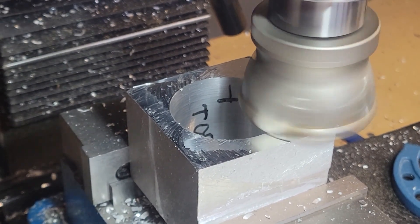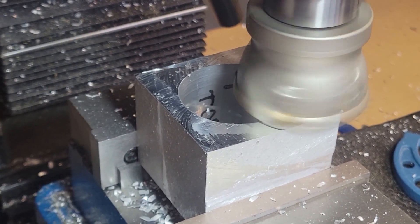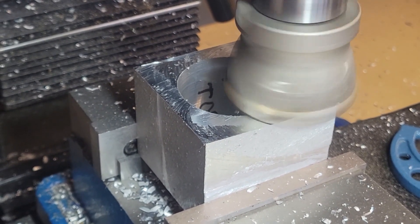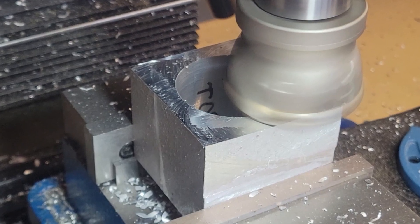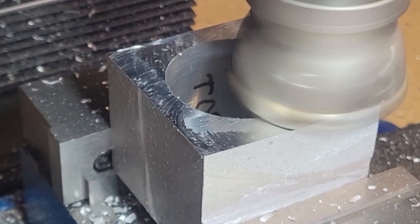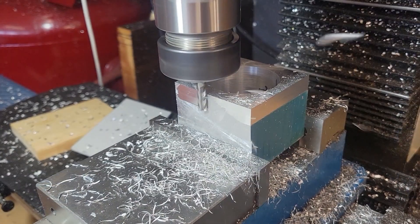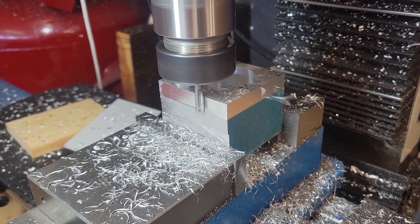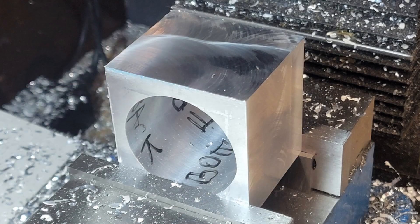Now we move to the mill and take that faced surface and mount it down on our parallel blocks. We need to ensure it's perfectly flat against both of the parallel blocks so our bore is perfectly aligned and parallel to the Z-axis of our mill. This is how we ensure all six sides are parallel and perpendicular to the axis of that crankshaft bore, and the bore is centered perfectly in our crankcase. We fly cut the top — that gives us two surfaces parallel to each other and perpendicular to our bore. Then we run an end mill around the outside of the part and that gives us the four remaining sides. I'll put a link in the description below to how I square up a block to an existing bore.